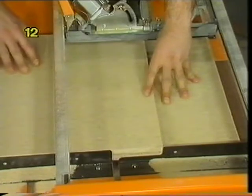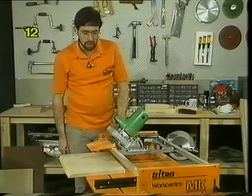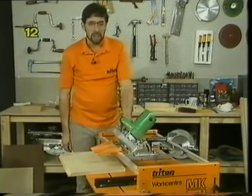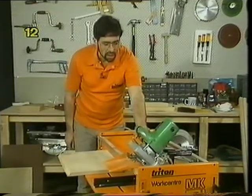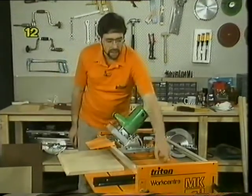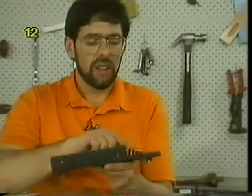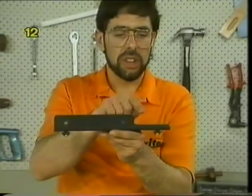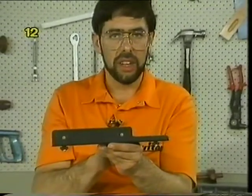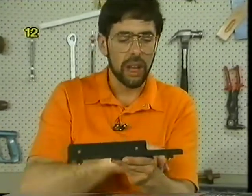Another thing to check: when you are at 45 degrees or your selected angle, do a complete dummy run and make absolutely certain that your saw blade can't hit the notched work stop. The notch in the left-hand work stop is to admit the saw blade when it's angled. Most saw blades will sail through that notch at 45 degrees, but at shallower angles always check to make sure the saw blade is not going to hit metal. That's why you do the dummy run.